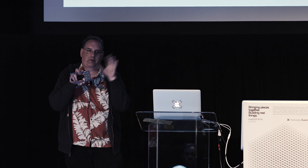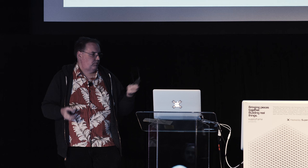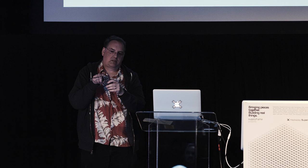You'll notice that these are individual boards, but they're in a panel, and the panel connects all the boards together to hold them stable in a matrix. But when you're done with the pick-and-place stuff, you get back these panels. Now you've got to chop the individual boards out, because you can't use 30 of them at a time. You have to separate them. So there's two processes for that: tab routing and V-grooving. They make weak points where you can split the boards apart.